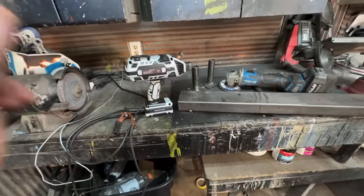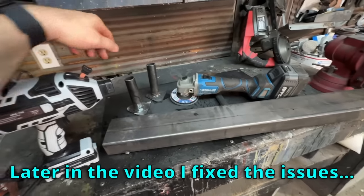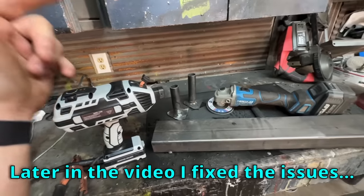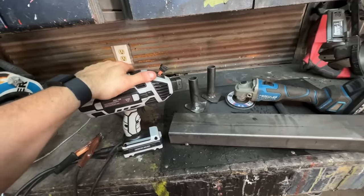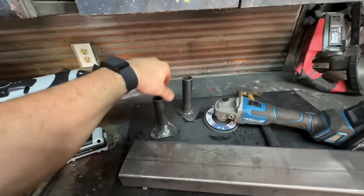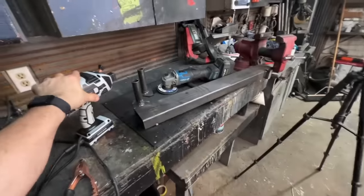I will say the duty cycle feels a little odd. This took whatever — 10 minutes to weld — and at the end it just acted like it was on level three, like it didn't even want to arc. I was like maybe the ground's bad, but the ground was okay, we had good clean metal, and then randomly it blew the breaker — I wasn't even using it, it just tripped. That's all kind of funky.